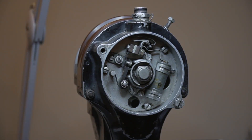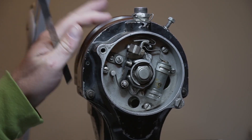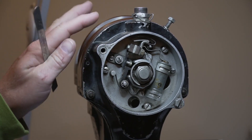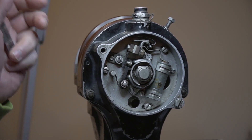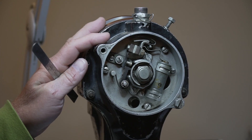We are going to cover a Bosch mag that came off of an R985 Pratt & Whitney engine, and we're going to go through in this video how to actually set the timing internally. I'm going to do a separate video on how to set it on the engine itself. There are two different things that you have to do to get this mag to work on the engine.